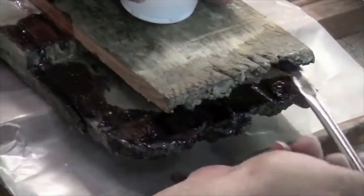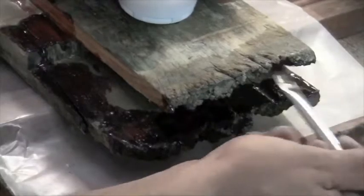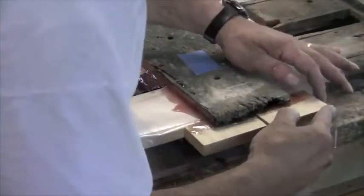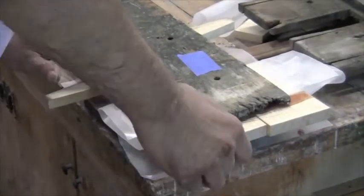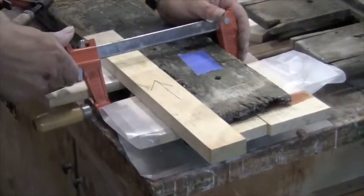This epoxy, particularly at this temperature, will soak in, realistically not very far, a 1/16 of an inch, but that's an awful lot of, I mean, that's thousands of wood fibers that it'll come in contact with in a 1/16 of an inch of penetration. So look at me go, huh? Goober it up. It's a great gap filler.